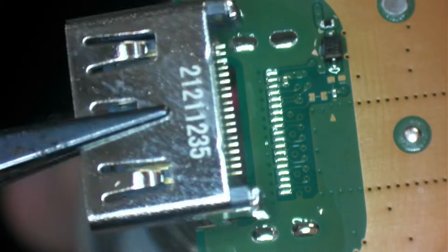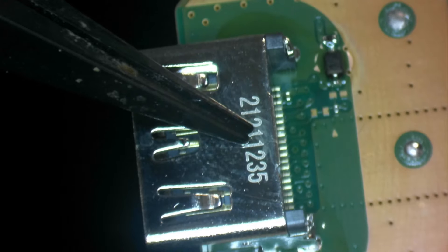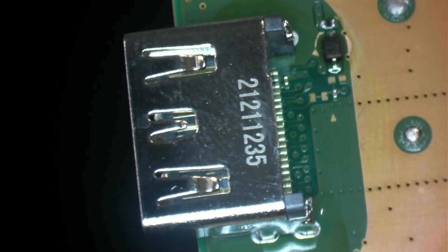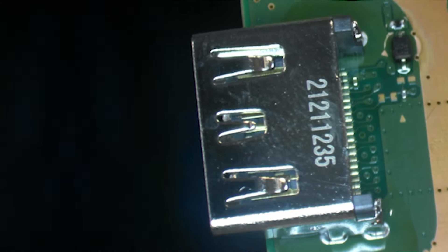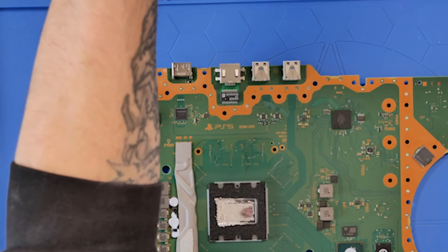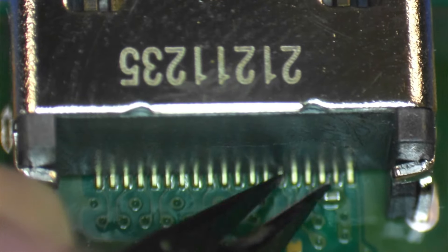Got our new port here, so to install that... Now that should be in place. We'll get back on the overhead and have a look — give that a test to make sure all those pins are where they need to be. Back on the overhead — that seemed to go okay, but we need to get back onto the scope and have a look to see if all those pins are soldered down. I'll just give these a nudge test and fingers crossed they're all soldered into place.